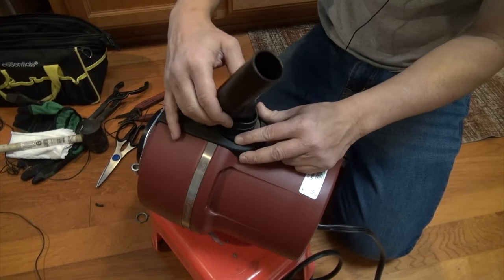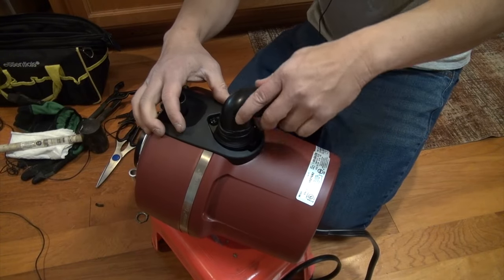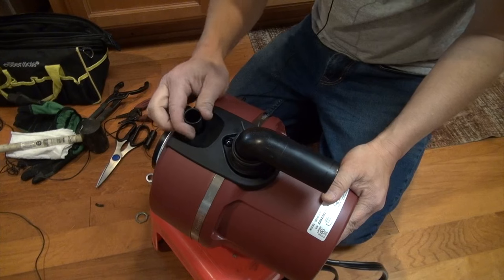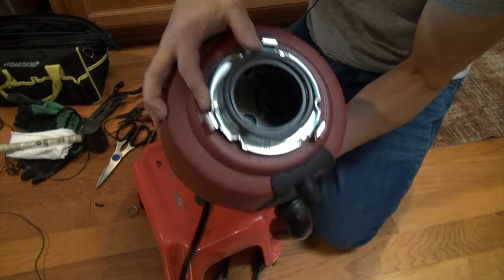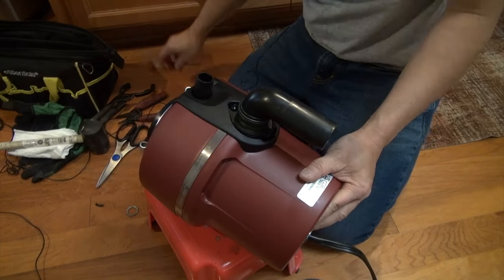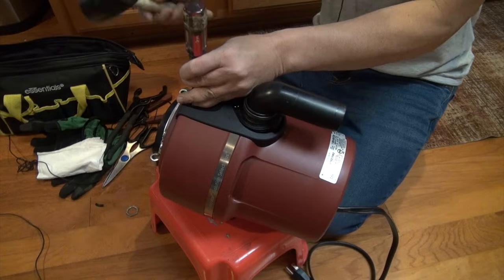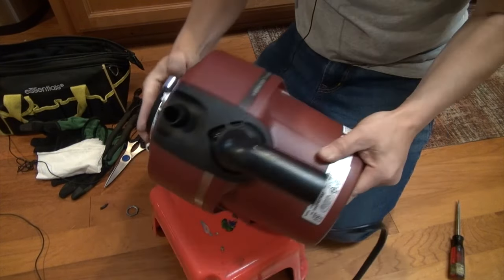I would install this drain arm part now so I don't need to deal with it when I'm under the sink, because there's very little space to work with under the sink. I'm going to put this in there and insert the clip to lock it in. So this is the drainage part — the top part is for the dishwasher. Currently the dishwasher inlet is sealed inside. Just in case you don't have a dishwasher, you don't need to open this. But since we have a dishwasher, you have to break the seal loose. Once you break it loose, the parts will come off and you just have to carefully collect all of them.